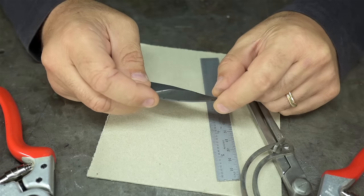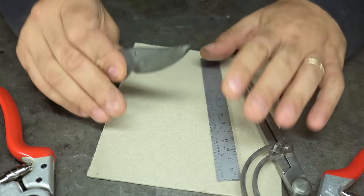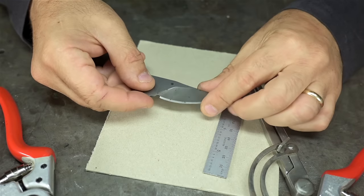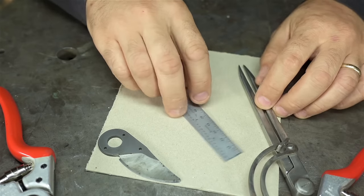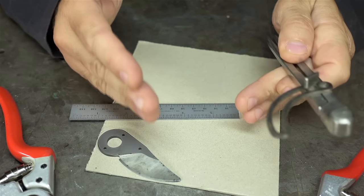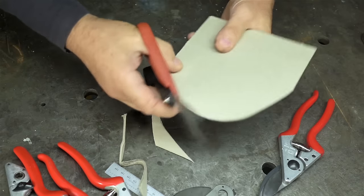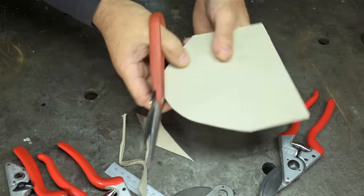To answer your second question, and only partially address the first, I'm going to build a very simple jig using just some cardboard, or cardstock. We now know from the CAD that this belly has a clean radius of 55 millimeters. That means it's part of a circle with a 110 millimeter diameter. Simply divide 110 by 2, and voila, we can set our calipers to 55 millimeters. So we don't actually need this whole circle. This stuff is terrible to cut.